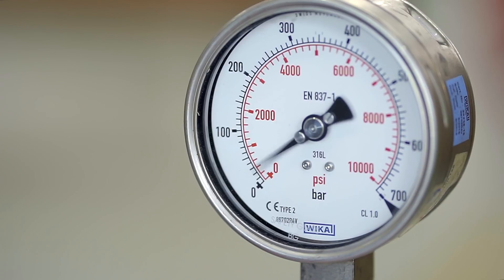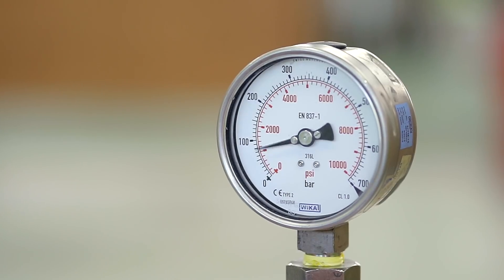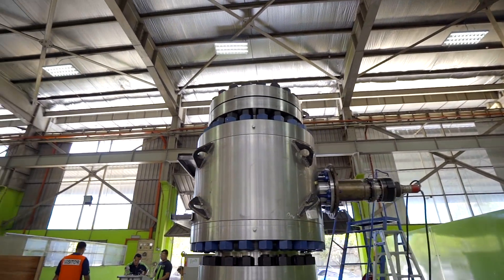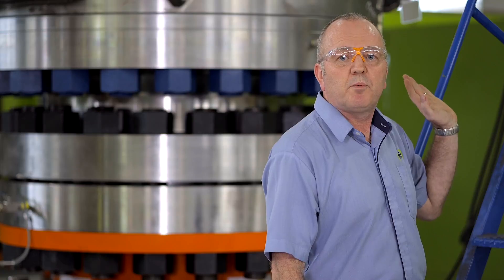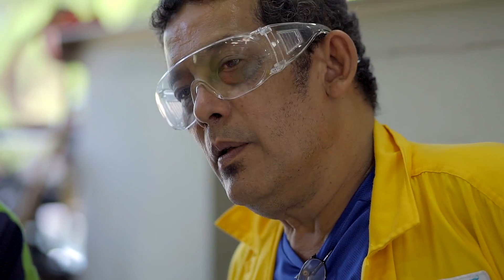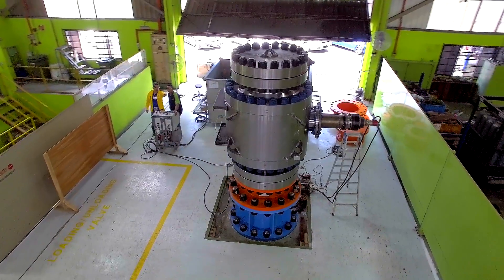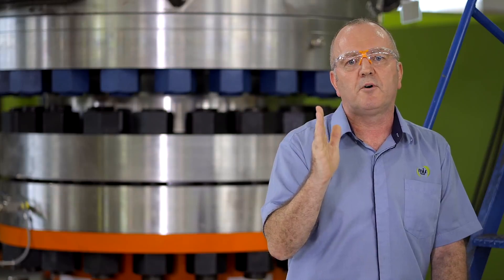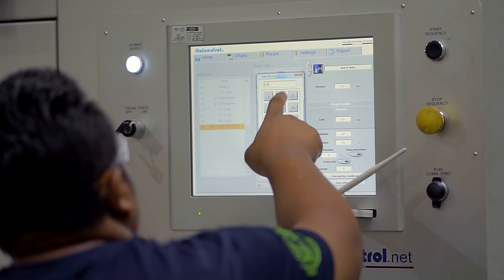This is very important to simulate site conditions. This will be an actuated valve, and you can see behind me that we will put it in the vertical position throughout the whole factory acceptance test. This is quite unusual. Normally the valve will be in the horizontal plane, but this valve will be installed in this vertical position on an offshore platform, so we are replicating as close as possible the site condition.